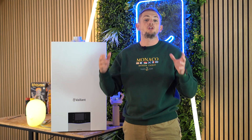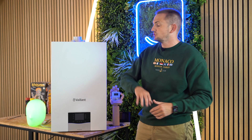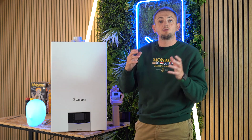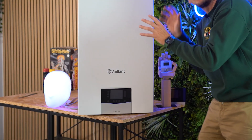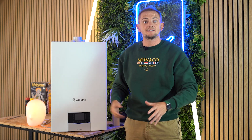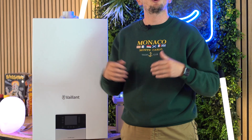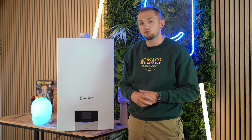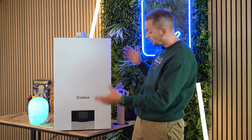If you're planning on putting your boiler in a cupboard, make sure it's going to fit, and allow for clearances around it — those dimensions are for the boiler only. Don't forget you'll have a flue on top and pipe connections underneath, so fitting one in a kitchen cupboard can be quite tight. Visually this boiler isn't going to offend anyone — Vaillant boilers always have a slight curve to their case, and it has a nice digital display at the bottom.